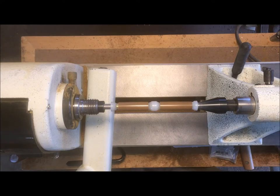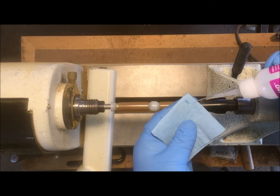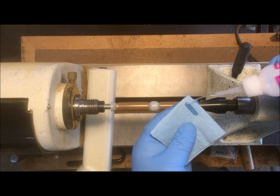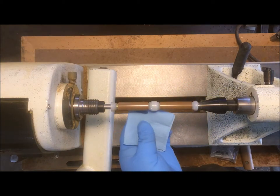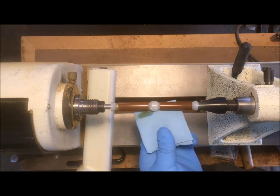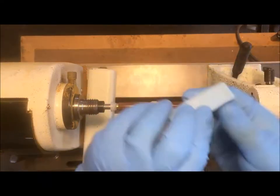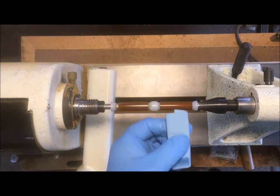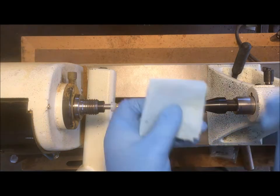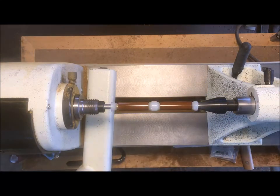It's time to look at what type of finish we'd like to put on. I prefer a CA finish, which is basically layers of superglue — it's a very durable finish but there's a little bit of a learning curve in knowing how to apply it. There really are a lot of finishes out there that you can try on your pens: anything from an oil finish to a wax finish, ready-made friction polishes, or even lacquers and polyurethanes. Really the sky is the limit and it depends on how you want your finished product to look.